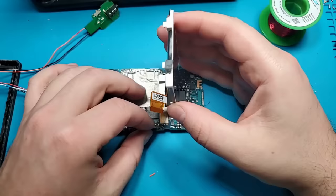Up next is the SSD. For this thing to fit, I'm going to have to remove it from this little enclosure. Even though it's larger in size, this SSD should draw less power than the original drive. This will extend the battery life of the new battery even farther. I will plug in the SSD using the original Zune ribbon cable. Here, I'm using some Kapton tape to keep the battery and the ribbon cable from shifting around inside the device.